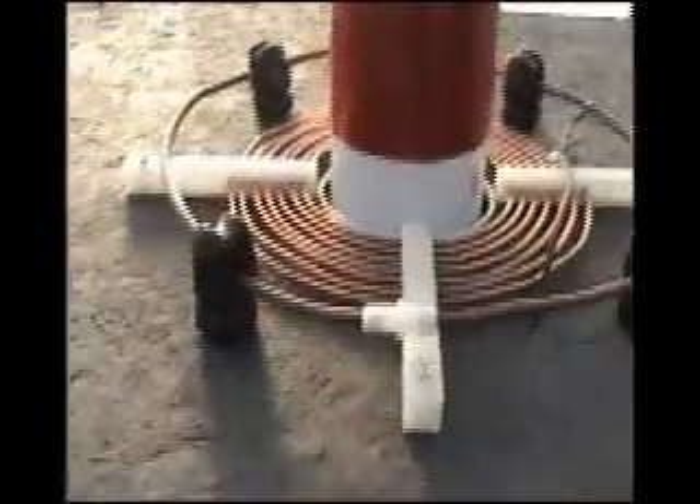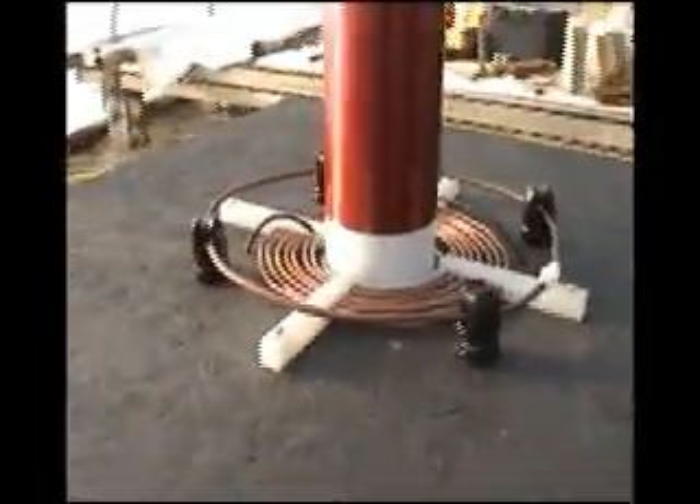What we have here are three buckets of very high power microwave oven transformers wired in anti-parallel with a center tap ground. That right there is our knockoff Tupperware RF choke — it's currently missing some capacitors, but that's okay. And then we have a gift from Mr. Wingate: our Maxwell High Voltage Capacitor, which has some nice capacitance. We have our primary coil here, and our lathe-wound secondary that goes up to our dryer-wound toroid — well, lathe-ish wound.